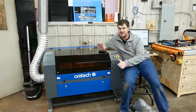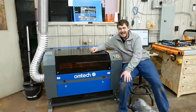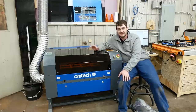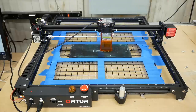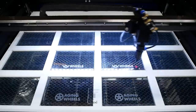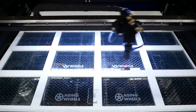But for this project specifically, CO2 lasers do not operate on a visible wavelength of light — they can directly engrave the glass, which means I don't have to paint it first, which is a nice and huge time savings. And this is faster than the diode laser — not just a little bit. The diode laser I can engrave glass up to 3,000 millimeters per minute. This one I can engrave glass at 500 millimeters per second. That's 10 times faster — this can engrave faster than the diode laser can even move.